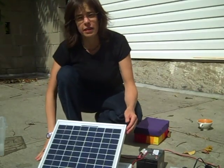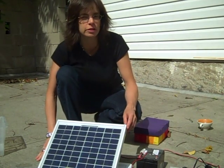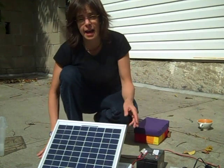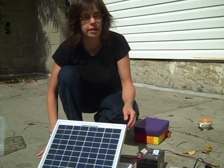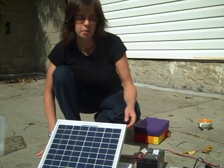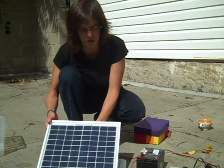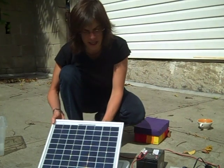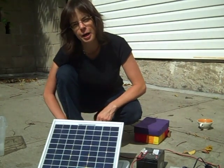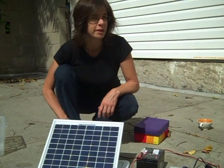So now as I said we have a 10-watt panel. The entire system voltage is 12 volts and the panel is rated at 0.61 amps current, so the peak power current is going to be a little bit more than that. Indeed when the sun is shining on that just perfectly — well it's a little hazy now — but if the sun is shining really perfectly on there, it would be getting peak power at about a little over 0.7 amps.